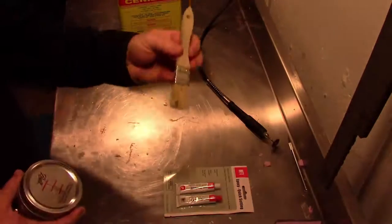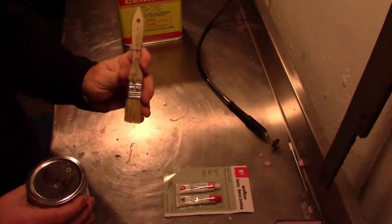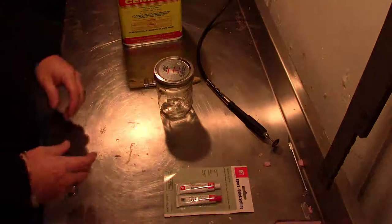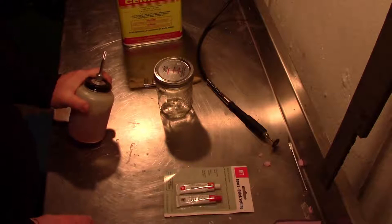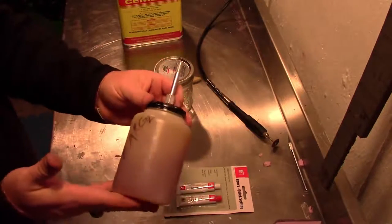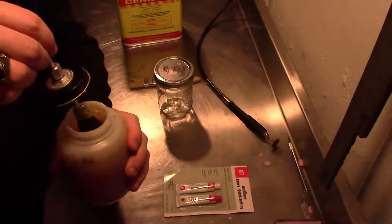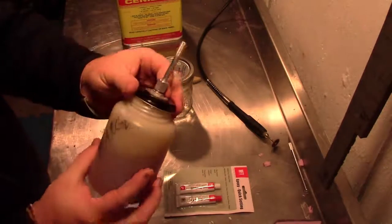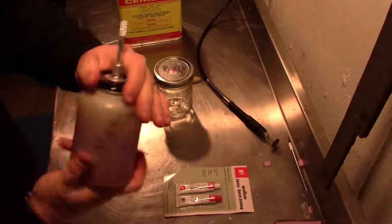You could put it directly into a jar, but every time you use something such as a chip brush to get some out, you can't really clean them and you have to throw them away. The only way to really preserve a brush is to keep it in the Barge until the next time you use it — that will preserve it. They make glue pots for that, and glue pots range from $25 to $90 and probably beyond. I refuse to pay the big dollars for a glue pot. I bought this alternative, which is a plastic container with a lid and a brush that goes through the lid. The only problem is that if you get any Barge between the lid and the rim, it will gunk up and be hard to get off.